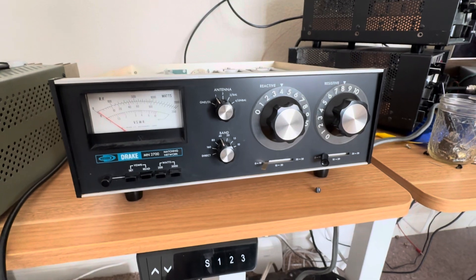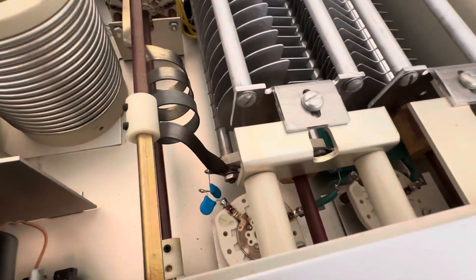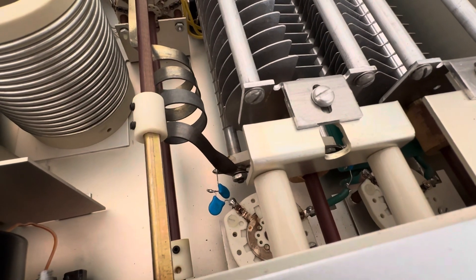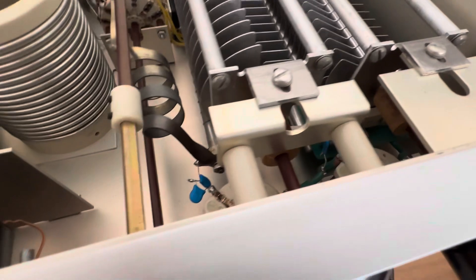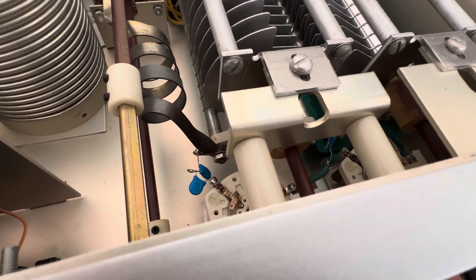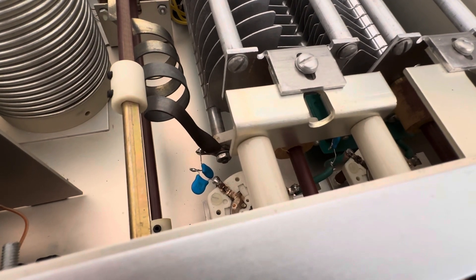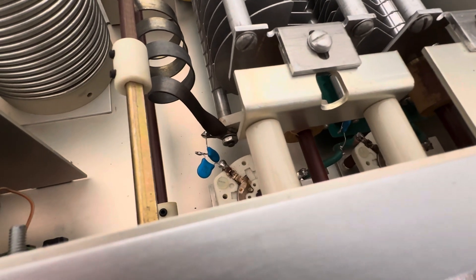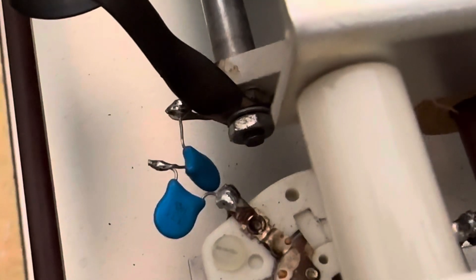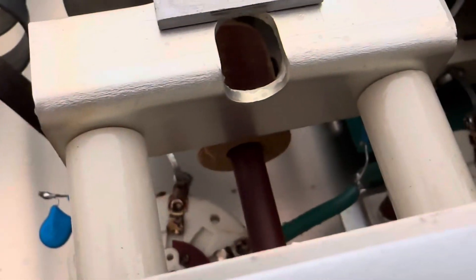I've got to put some real power into it and make sure the capacitors I put in right there don't fry up. I still don't like what I did there, but those are 3 kilovolts in series making 6 kilovolts, and they're about 330 picofarads in series. We'll see how those work out — I hope they don't flame up when I put in 1.2 kilowatts, but I guess we'll see.